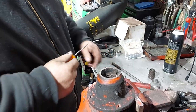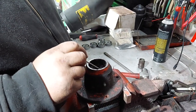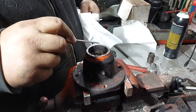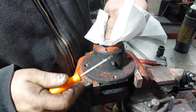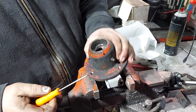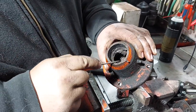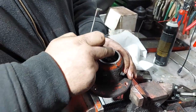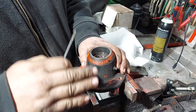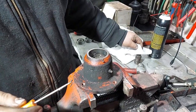So here's the new bearing. What we usually do is clean off the old grease out of here — if you're going to leave one side of the seal off, definitely pull the old grease out if it doesn't look fresh. If it's hard and nasty you have to clean it all out. There's a snap ring right in here — that's what holds and retains your bearing. The bearing gets pressed in and rides up against that snap ring so it doesn't go any further. When they bottom out, don't beat the hell out of them because you'll bend the snap ring, it could come out of the groove, and the bearing will go in too far. This piece of pipe spacer is kind of a backup.